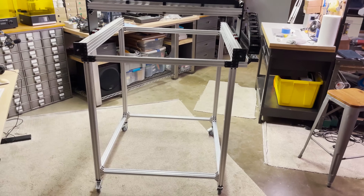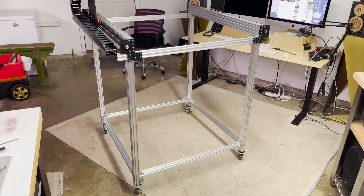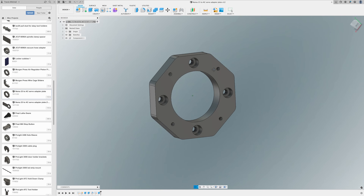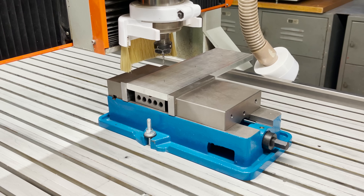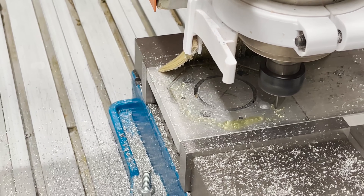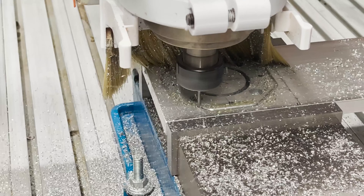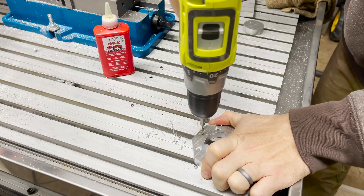I'm really just making up this design as I go and will expand on it later, but first I need to make some parts so I can attach my AC servo motors. The motors I bought have a slightly wider hole pattern than the plates that came with the kit, so I quickly modeled up these adapter plates. I get set up to mill these out of aluminum plate and I make three of them — two for the Y axis and one for the X axis. I have all the models available on my Patreon for all of the custom parts I made for this project. Here is the milled part — I just have to grind off the tabs and tap a few holes.